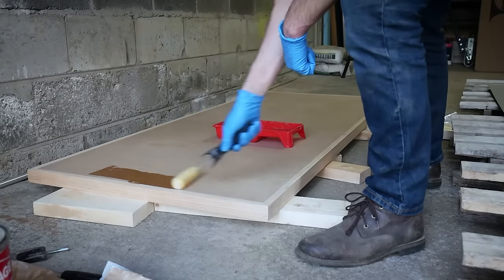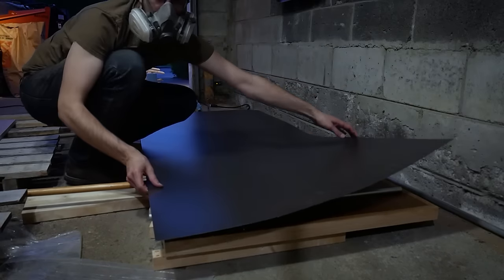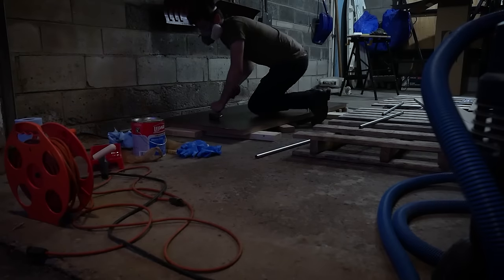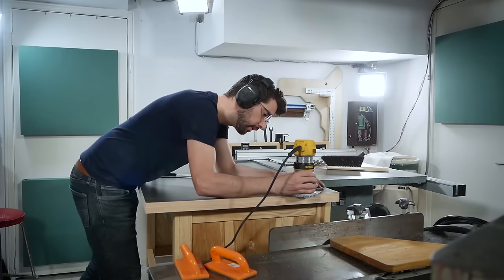I then heaved the top back out into my garage once again to apply more contact cement and laminate down this sheet of graphite gray Formica. Formica was oversized, so I used the sponsor of this segment, the flush trim bit, to make it perfect. I also broke the edge using a chamfer bit because the Formica gets really sharp.